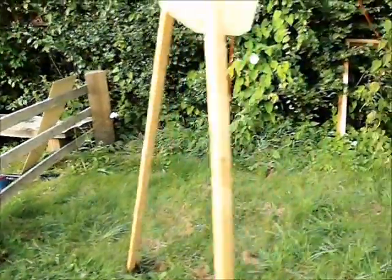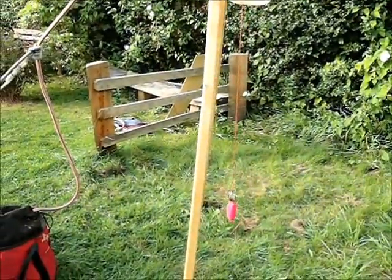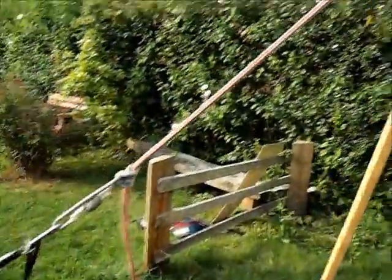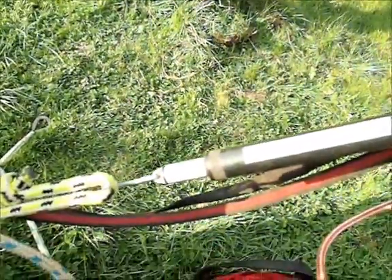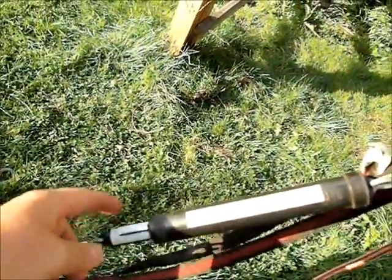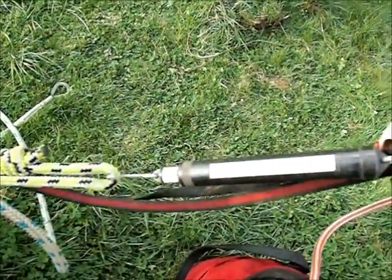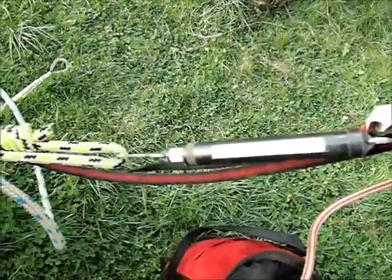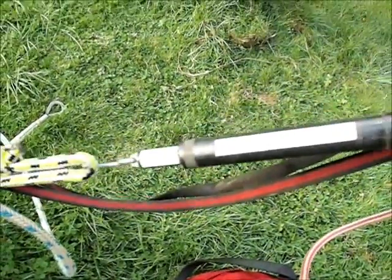So it's probably leaning at the moment about 5 degrees forward, something like that. And considering there's 10 kilos on the hook, we are at about a kilo and a half of strain on there. It's quite interesting — when you bring the whole rig back it's still basically weighing a bit of the rope, so it never quite gets back down to zero. But yeah, let it go forwards and there's a kilo.